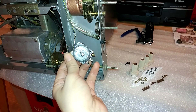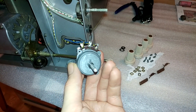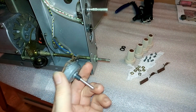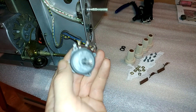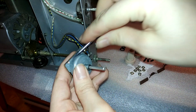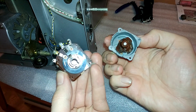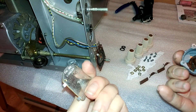There we go — that is a monster of a potentiometer. At least they were nice enough to extend the cables a bit, so working with this thing is going to be a lot easier. This is a 50k potentiometer. Sure, you could just put in a new one if you really wanted to, but why not just fix it? The way this thing is constructed, we have four clips and we can just take a very small sharp screwdriver, lever it underneath, and undo all those clips. With the clips undone, we can just disassemble the potentiometer. Just look at how huge everything is — it's absolutely ridiculous.